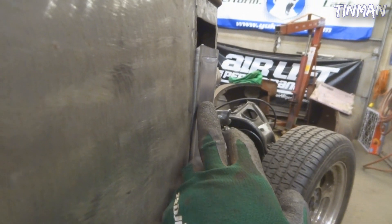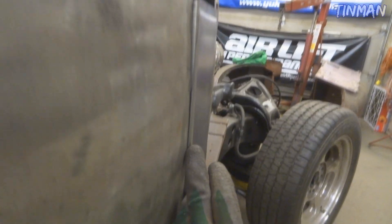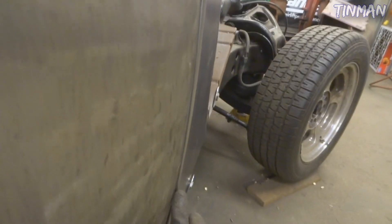I'm going to take it over to the car and throw it in this door gap, then I can check the radius against this door. It's pretty close - you can see the ends need just a little bit more. So I'm going to give them a little bit more of a shrink, and that'll be pretty much dead on.